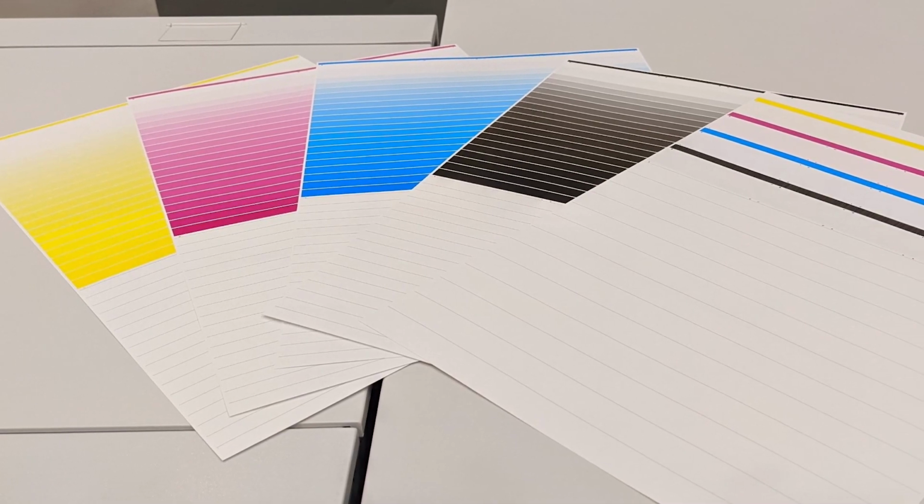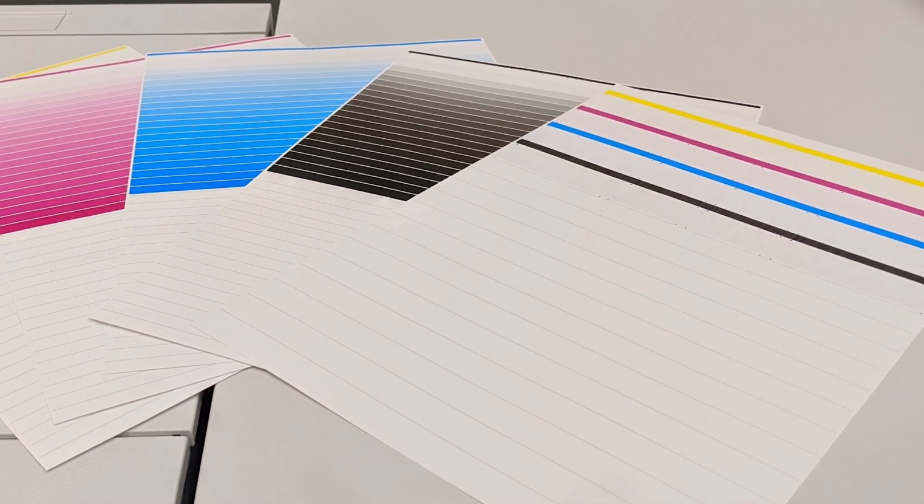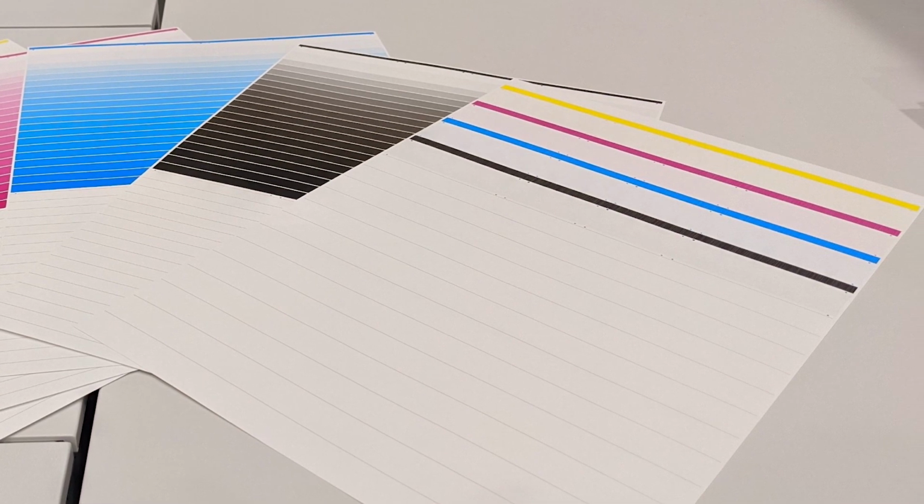For a dynamic NUC to make a change, 4 quality charts are printed and scanned, 1 per color, and the frequency of these dynamic charts can be set by the operator. Dynamic NUC is an optional fine-tuning step in addition to the static NUC. However, by using the dynamic NUC procedure, it will help maintain the quality of the system over time and over all media types.